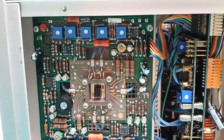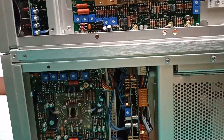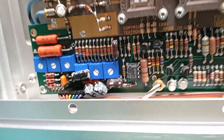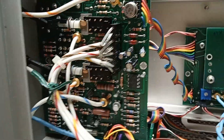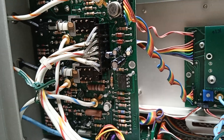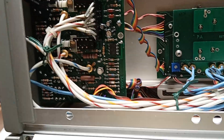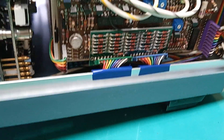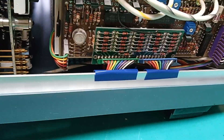Don't bend any of the cables — they've been formed in place for 40 years. All these electrolytics were changed without taking any of the boards out. On this board I actually cut the capacitors apart — the new electrolytic is soldered to the stubs of the leads of the old capacitor, still through the board. Beware that those wires down there can't rub against the frame; I put tape on them so they can't rub.